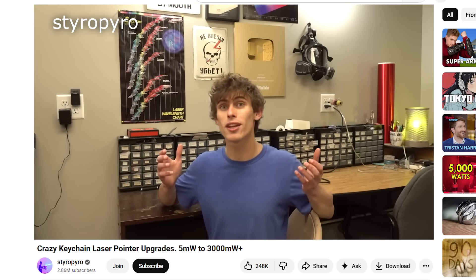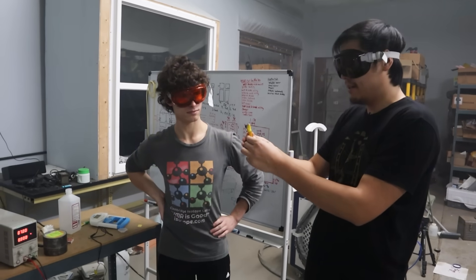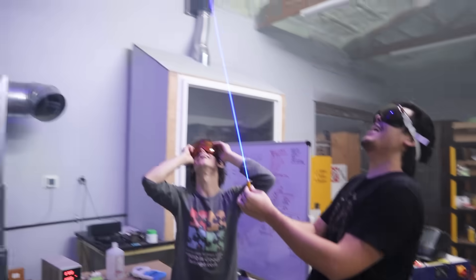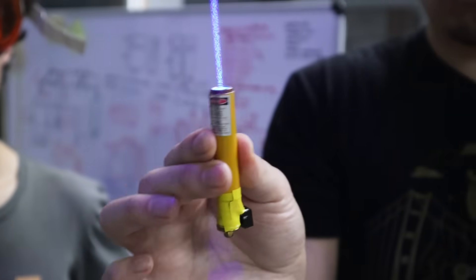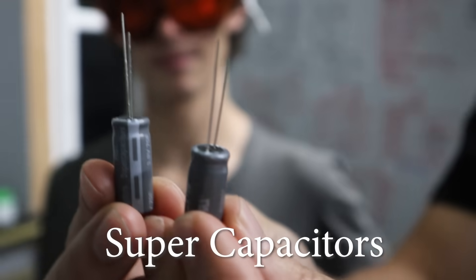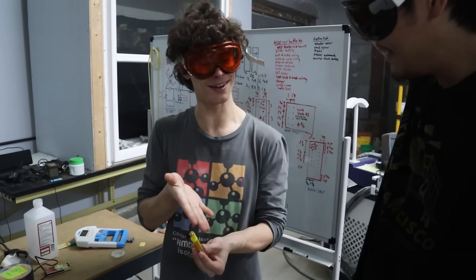It looks like I found a video of this guy who made a tiny burning laser the size of a keychain laser pointer. And that's me — we're here with Drake Anthony and he's going to show me his little thing. Drake was so excited to show me how he was able to cram five watts of laser power into something the size of a baby carrot. The power supply is just two super capacitors, and they store just enough charge to power a laser for about 30 seconds — but not enough charge to burn the laser out. It just relies on those caps being kind of garbage to not kill the laser diode.